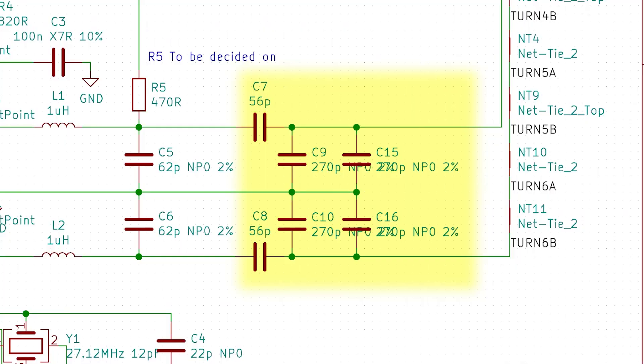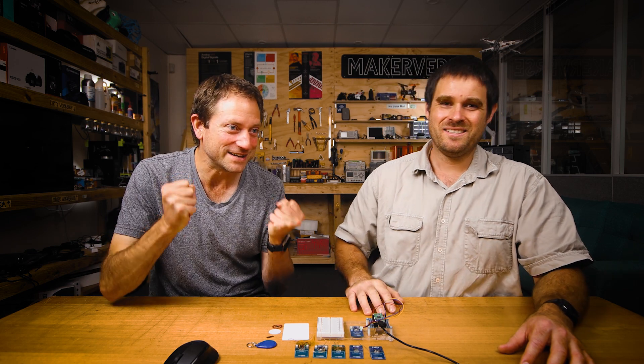We need to stop stray components above that 13.56 megahertz that we're actually interested in. So we have to design a low-pass filter. After the low-pass filter, we need to do impedance matching from the low-impedance driver IC to the relatively high impedance of that antenna. We have to build a matching circuit using passive capacitors and inductors, and also make sure we don't burn out the chip — we want to get as much power transfer as we can, but we don't want to burn the whole thing up.